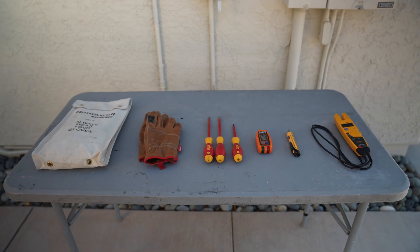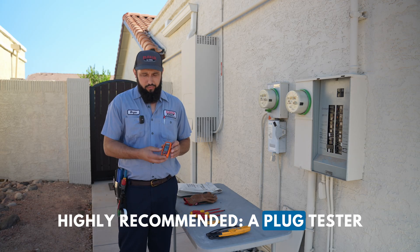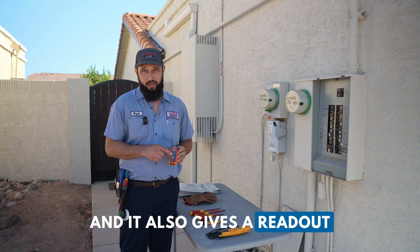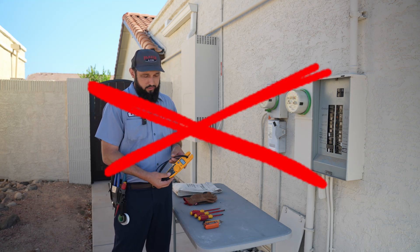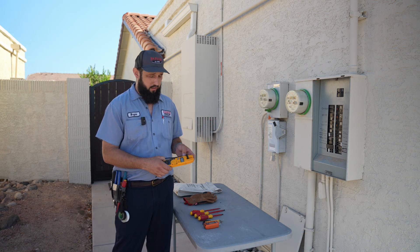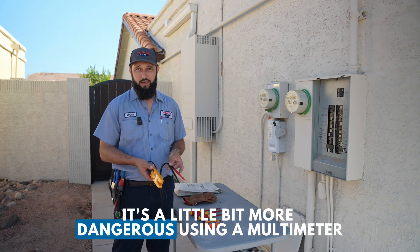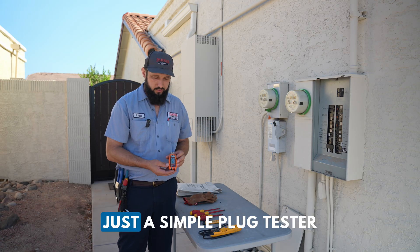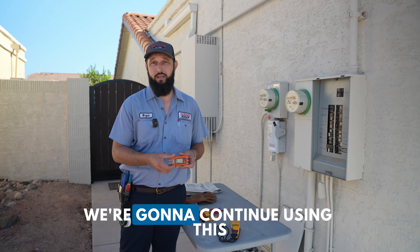Here I have a few different tools you can use for testing electrical power. Highly recommended: a plug tester. This will fit your receptacles and gives a readout of the voltage coming out of your receptacle. A multimeter is also an option, but I don't recommend using one unless you're well versed in electrical — multimeters can be very tricky, and you're sticking metal parts directly into live receptacles, which is more dangerous. If you're new to electrical, a simple plug tester with a voltage readout is the best. For the sake of this video and your safety, we're going to continue using this.